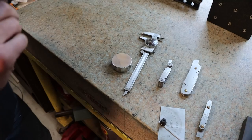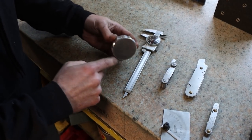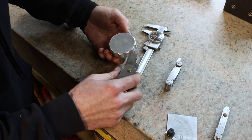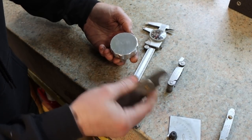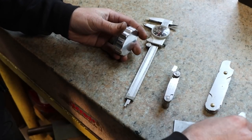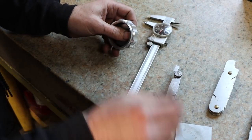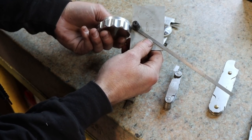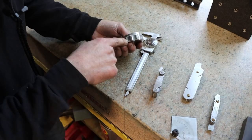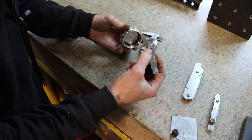So I say this is a simple cap, and it really is, but if we want the cap that we make to look like this one, we need to be able to measure all the features that are on this. So we've got 12 finger holds. We can replicate those finger holds with a 3/4 inch radius, 3/4 inch end mill, right? 3/8 radius. We've got a radius out here on the front edge that is 11/64. And then we've got an angle right here that I have measured out to 35 degrees. You know, we could take a 60 degree cutting a threading tool and run up to that and act like we didn't see that other 5 degrees and it wouldn't make any difference, but, you know, or we could angle the tool post as well.